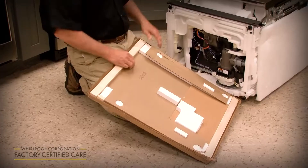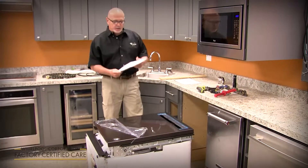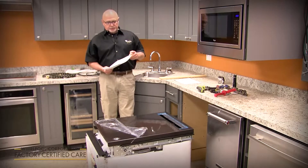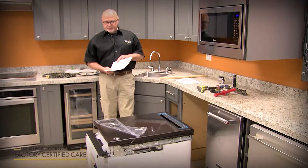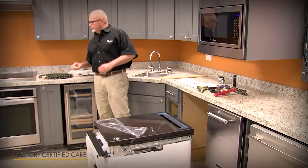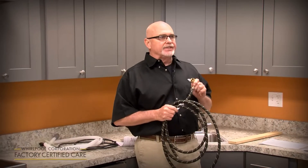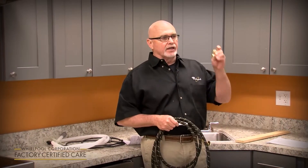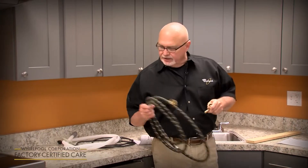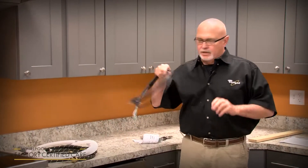If you've got a built-up floor, you can use the boards as runners to even out the floor. Once you've got the literature out, review the installation requirements, tools, and parts page. You may need accessories such as a water supply line and elbow fitting. If you buy a water supply line kit it comes with the elbow fitting; if not, you still need to purchase a three-quarter to three-eighths inch elbow fitting. The drain hose is supplied with the dishwasher.